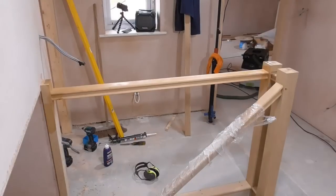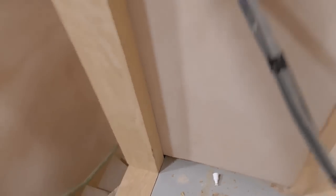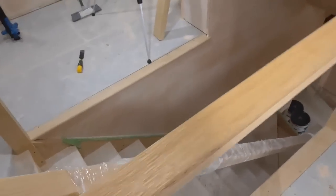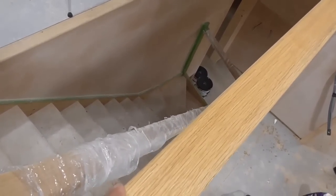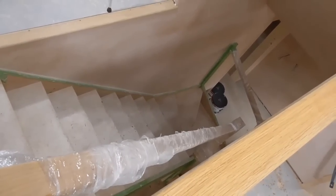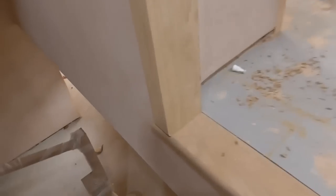I'll get that cleaned off and there are a couple of screws to put in, then I'll show you. That glue is cleared off so we can have a quick look - that's gone in there a treat. We've got a nice joint in there. It's hanging over here slightly - I'll show you from the other side. It went in just scuffed slightly but not the end of the world. I've got a fixing to put in there which I'll cap over, and a fixing at the bottom which I'll put low enough so it comes behind the spindle base rail. I also need to just double check here that the handrail is in wind with the floor capping, because if that's out it'll look absolutely terrible.